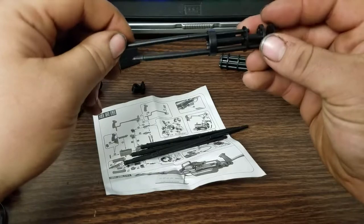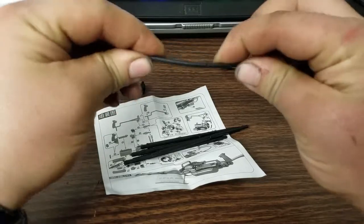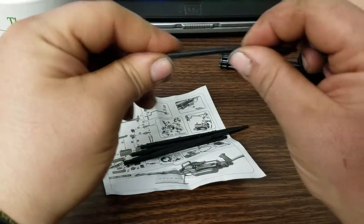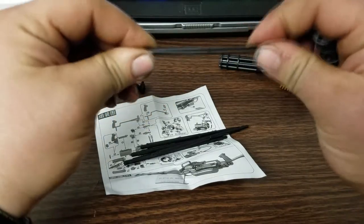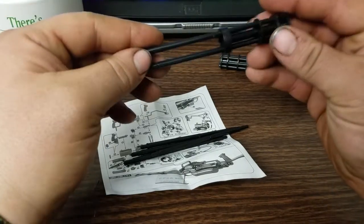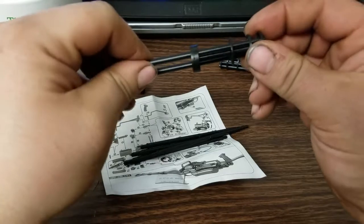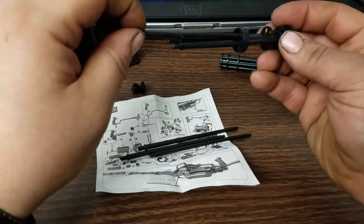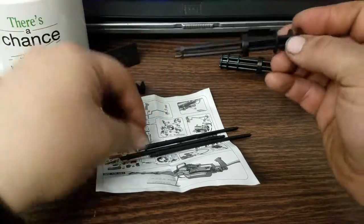Put one on the opposite side to get it stable. That one is bent just a little bit, so we'll gently persuade it back mostly in line. If you get components in kits like this that are kind of dramatically bent and don't really want to straighten out, you can heat them up a little bit. One safe way to do that is to heat them up with really hot water, like almost boiling. You can also use a hair dryer or a heat gun — or if you're a little more adventurous, like I tend to be, use a lighter or a torch — work quick.